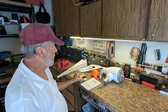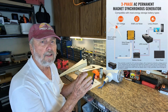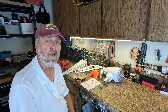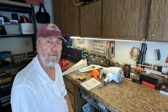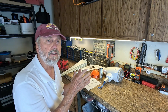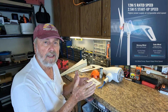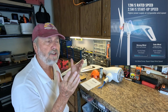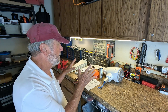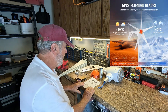You get a controller here — this is the wind controller. It controls the voltage to charge your batteries. This is used in conjunction with 12 or 24 volt batteries. It will charge the batteries and then you can have an inverter that will change the DC voltage to AC voltage to run fans and chargers for your cell phones and computers. This is a great charging device, a wind turbine generator.